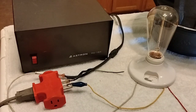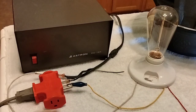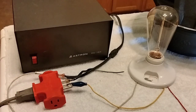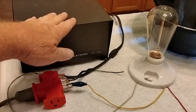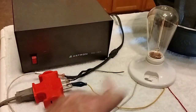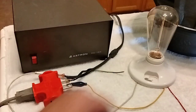Hello, I'm back. Maybe gonna get some people riled up about soft start on a transformer, and maybe somebody will learn something hopefully. So what I have here is this cord coming from an outlet down around the back, going into this and then into this power supply. The white wire here is connected to the yellow wire, the hot. So basically this is plugged into the wall right now. The only option is I can use this red wire instead of just going direct — and there's a reason for that. I'm gonna use that light bulb for soft start.